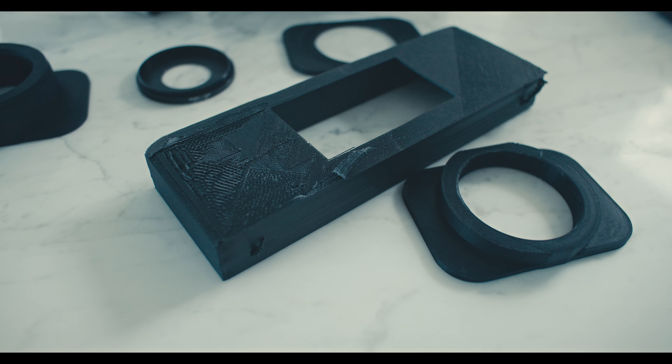With these key areas determined, I know which lens I want and what flange distance I need for my design. If the distance is 70mm, the camera has to have the lens 70mm away from the film back, which will protrude quite a bit — I need to make sure the camera is still portable enough. Knowing that, I'm starting my designs and coming up with prototypes to see what's feasible.